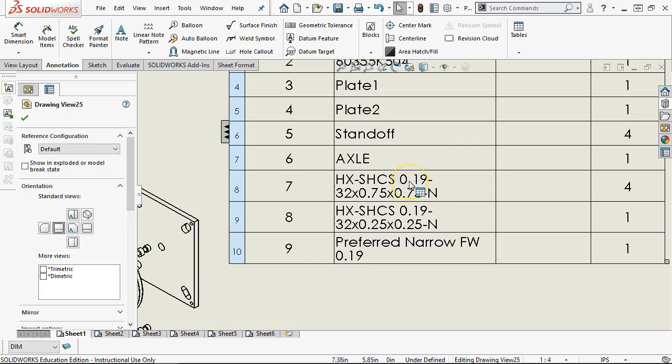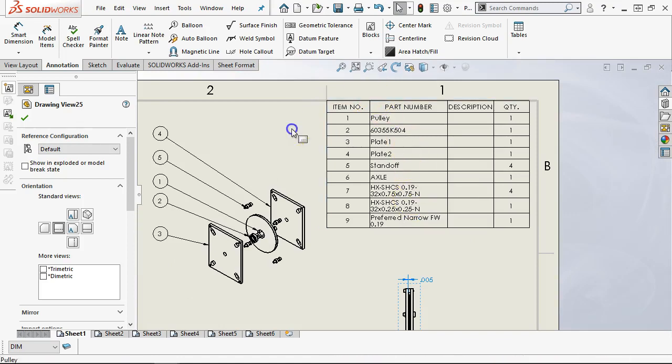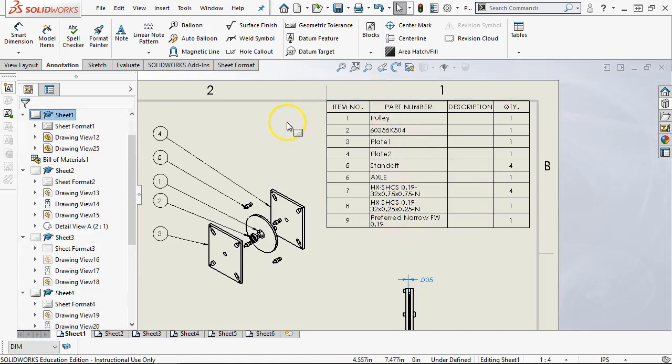All right, so basically the number 10, that is the major diameter, that is the threads per inch, that's the length. And then if there was a shoulder, that would be the length of the shoulder, and then that would be the length of the threads. So if I had a 2-inch long with a 1/2 inch of thread, this would be 2.00 by 1/2 inch, or vice versa, depending on which way it goes. All right, so number 10 washer, flat washer.